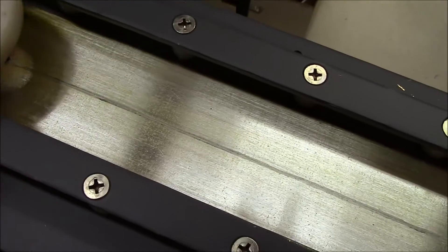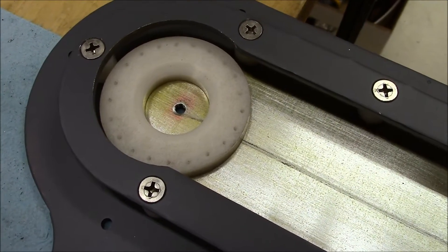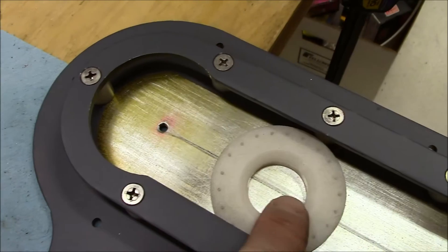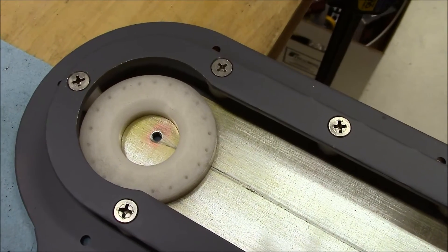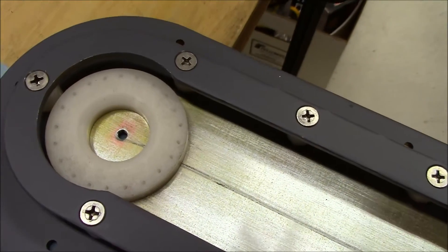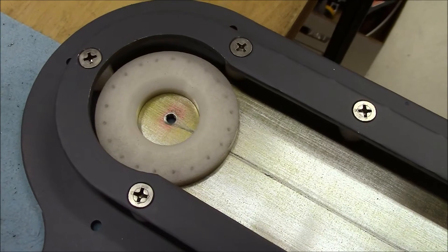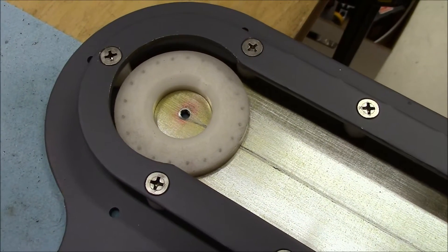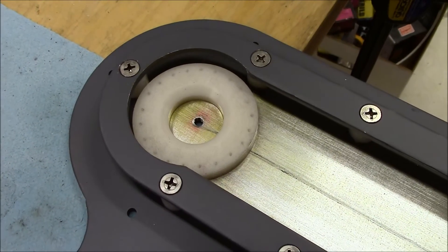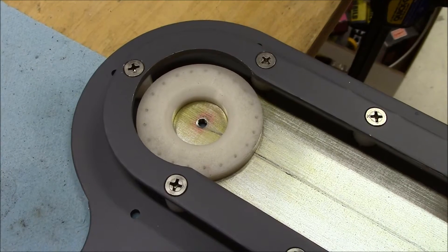In addition, there is a puck that goes in and it floats and rides with the actual bearing assembly. The upper plate that the seat is attached to actually moves back and forth, and this puck rides with it. It turns out that it's a good idea because it acts as a dust wiper and also provides some lateral stability for the bearing support — a real close tolerance fit, but essentially allowing for a dust wipe so that the bearing stays as clean as possible. These conveyor bearings are typically able to run dry, so really there's no maintenance or lubrication required in this system.